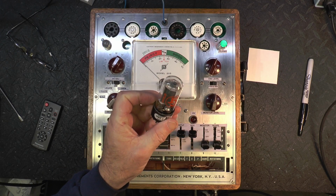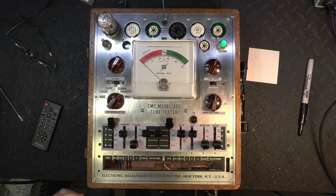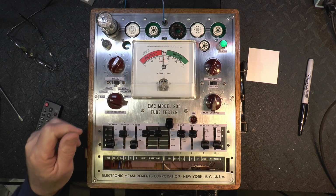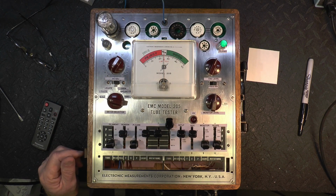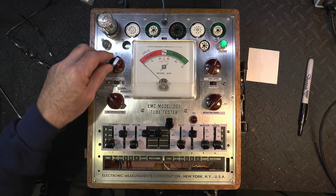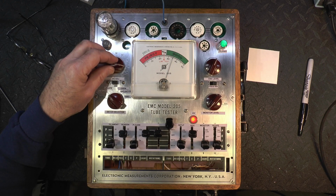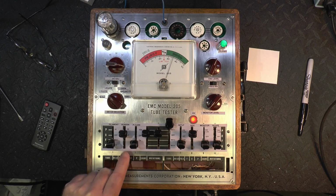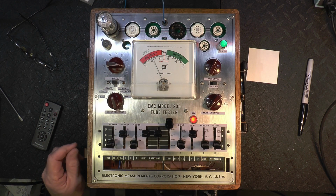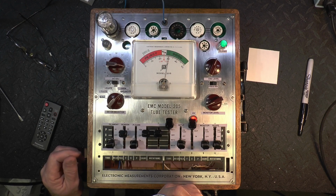We've got a Groove Tube 6V6, so we're going to try that one out now. Okay, filament. It's a little on the high side there. Let's try a medium. Yeah, medium looks like a good spot for the filament. Let it warm up a little bit. Power tube here. Set the plate voltage at 350 for this one. Plate current 1x. Screen low. So we'll look at plate current, and it's about 12 milliamps. Gain is sitting at about 30.25 or so.